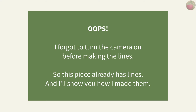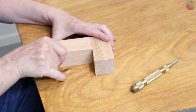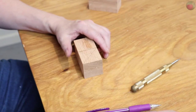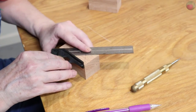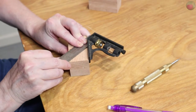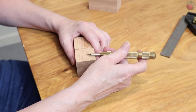I apologize for showing you this on one that already has the lines made, because I forgot to turn the camera on when I first made it. Hold or clamp your wood pieces butt to face and line them up on the outer left edges as square as you can. Then mark the center line where they meet. Use a combination square to mark the diagonals as accurately as possible, then use a center punch to mark the intersection of those lines.